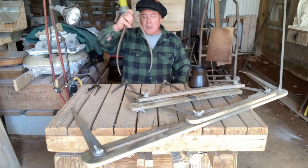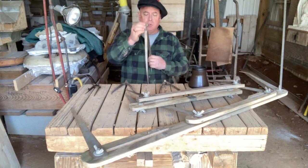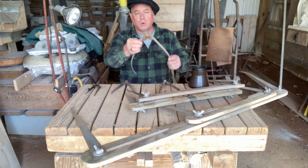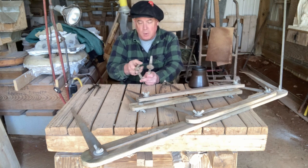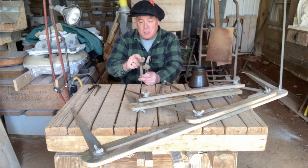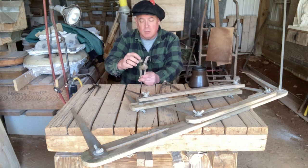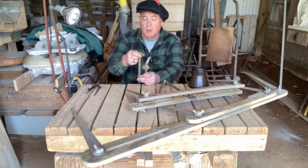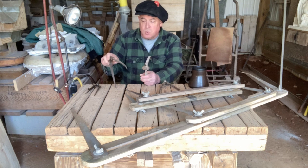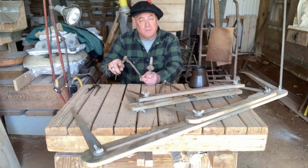Some of these Italian compasses are pretty nice — they've got wonderful smooth hinges. These are laminated forgings with a finger joint. What will happen is people try to tighten them, they'll hit it with a hammer, and they'll break them. The bigger problem is the brass shims wear, and as you go back and forth they become loose and stick out — literally like a razor blade, and they will lay you open. The danger is when they get a loose spot in the hinge or won't hold their shape. There's a certain range where they were used a lot and they'll be really soft.